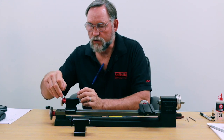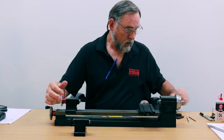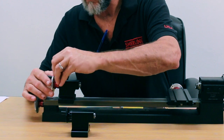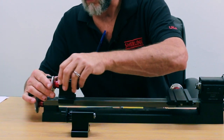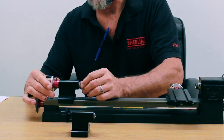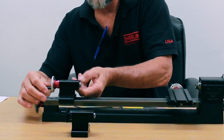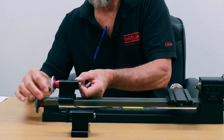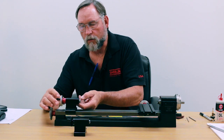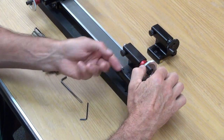It's a 3/32nds set screw — put your 3/32nds allen through into the hand wheel and you might need a little extra force; they put them on pretty good. So right now, as an exaggeration — if this was tightened down right here you would have all kinds of slop. That's how much slop there is now because I just moved the hand wheel; this is an insane amount of slop.